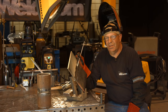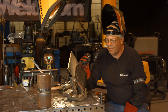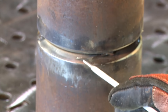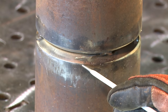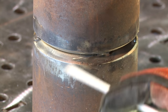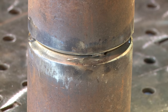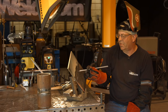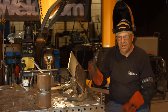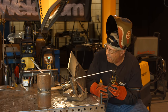I've seen a lot of horizontal welds lately where somebody said they're welding certain sizes of pipe and it's like they've got five beads showing. I don't get how it takes that many beads to fill that up. We could use less beads by running bigger rods, but I'm just trying to show you some technique. Alright, here we go - we've got to run bead number two.